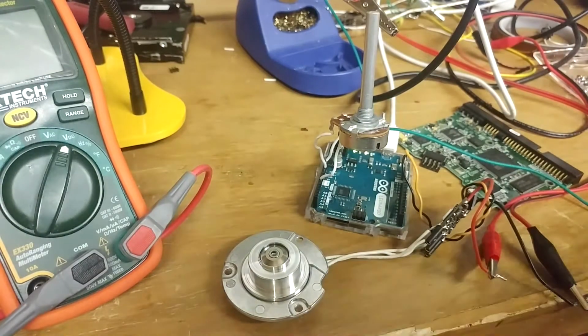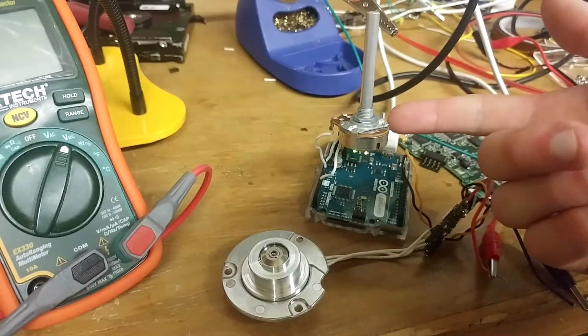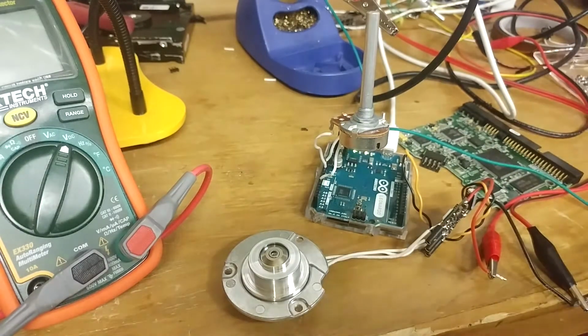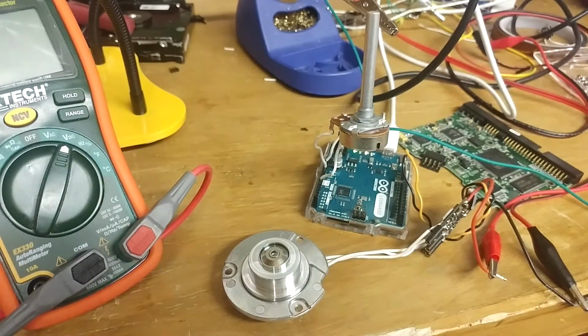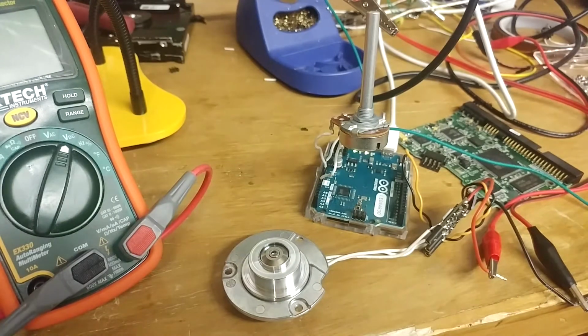So the Arduino just holds the throttle at the low value for about 3 seconds, and then it starts actually controlling it, and all it does is it reads an analog value from the potentiometer and scales that to an output value for the ESC. And that just uses the servo library. I'll put the code down in the description, so that way, if you're curious, you can see that.